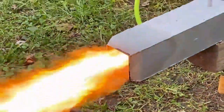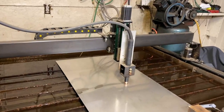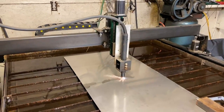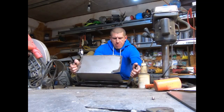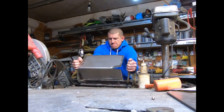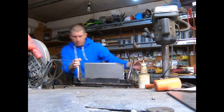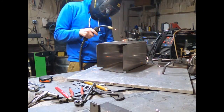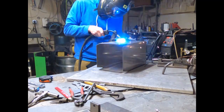So I decided to build a pre-burner cowling that allows us to cause different fuel stream velocities. This little box cowling that I'm building is going to allow different velocities of fuel streams inside the pre-burner combustion chamber, and that's going to be caused by the back wall. I made this out of a box because the first constituent of the combustor is already square. Circular would definitely be ideal, but I went ahead and bent this out on the brake to save on welds.